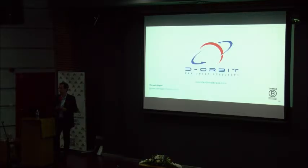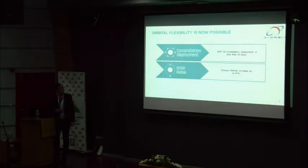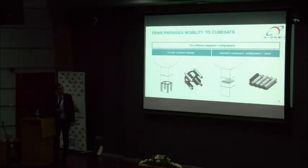Magnetorquers give you only micronewton-meters of torque. If your thrust vector or its average value is misaligned to the center of mass, you can have a huge torque disturbance on your satellite that will rotate it significantly even in 0.7 seconds — it can spin up to very high rates. The motors need to be assembled near the center of mass.